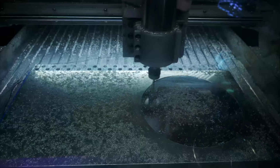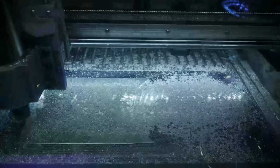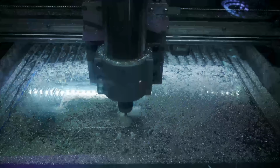This is kind of a weird facing operation. I probably wouldn't do this again because it wasn't super even. I went with an adaptive facing because it was so large, but I should have just done a normal straight across the top facing operation. It would have been more consistent. Not too much of a problem, though.